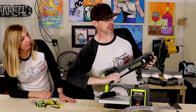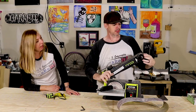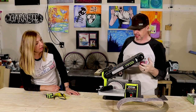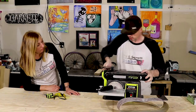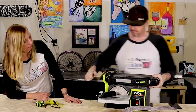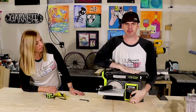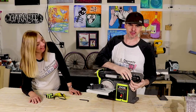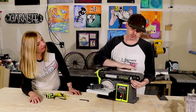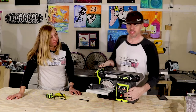Lower the tension arm, make sure it's nice and even. It says it's spring-loaded, pretty tight. I'm going to lower it down again and tighten it up. Now I'm going to turn it on and watch to see where the placement is on the pad — it'll shift one way or the other. Then you'll use this knob here to center it; it tilts one way or the other, creating more or less tension. Kind of looks like the belt rides in the middle.